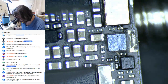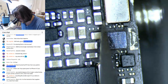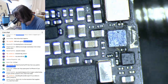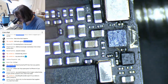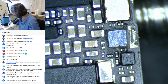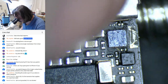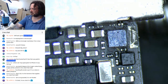That's not good. We've got solder coming out. Ah, jeez. All right. Guess we made a mistake. See all this underfill here? I mean, I know it's only the crystal, but I might get away, but I'm probably going to have to clear that back. No, that's not good. Probably going to have to clear that back and check out all the parts under that. This is my favourite shield. There we go. A bit late now, the horse is already bolted, but worth a shot.